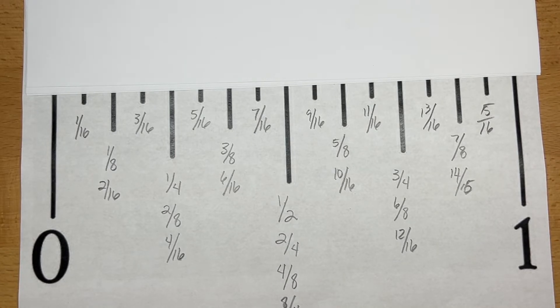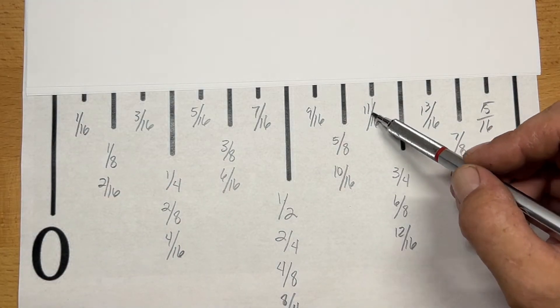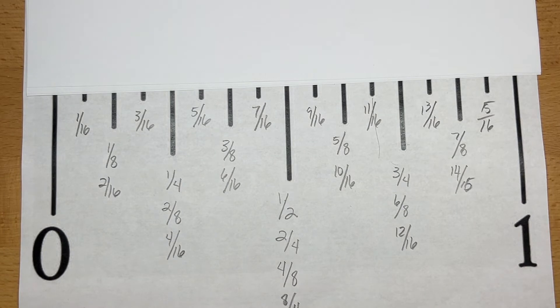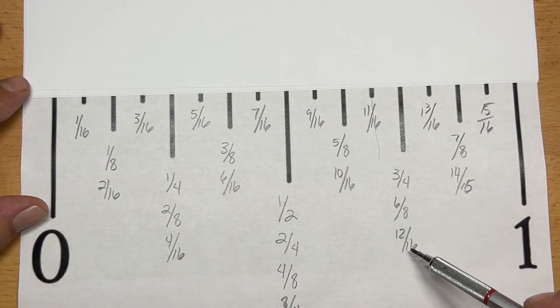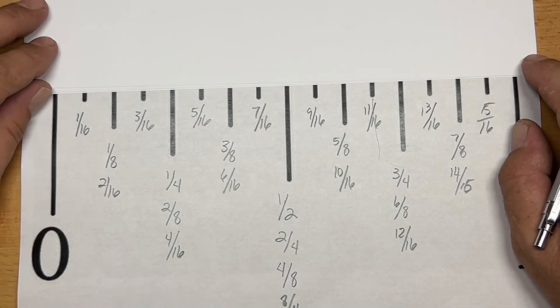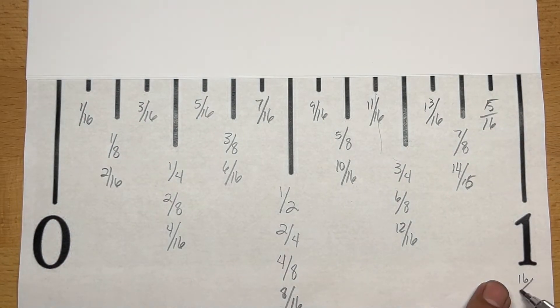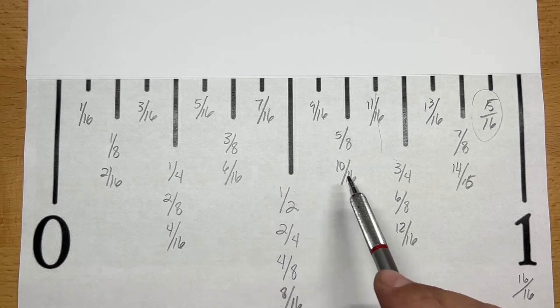One way I used to train myself when I was young on how to read the tape measure quicker is to know the equivalents. For example, if I was reading something that was eleven sixteenths of an inch, the nearest larger mark is going to be the three-quarter mark. It was pretty evident to me to split things up into quarters, and very quickly I could determine where the quarter marks were. By knowing that three quarters is the same thing as twelve sixteenths, I could take off one sixteenth and that would give me eleven sixteenths. Similarly, one inch is the same as sixteen sixteenths — take off one sixteenth and you quickly know that is fifteen sixteenths. This is how I trained myself, especially knowing the equivalent fractions for the quarter marks, half marks, and three-quarter marks.